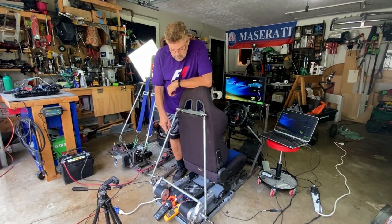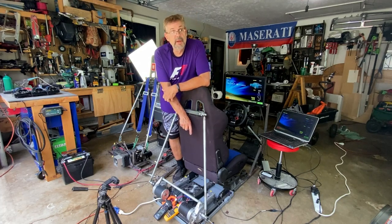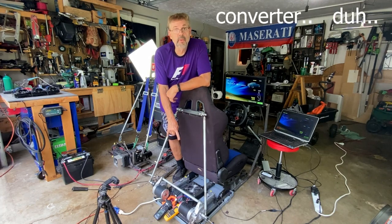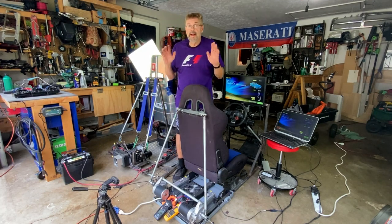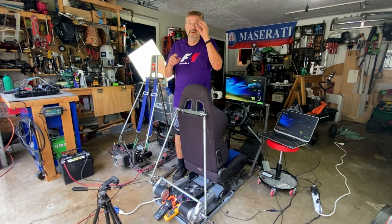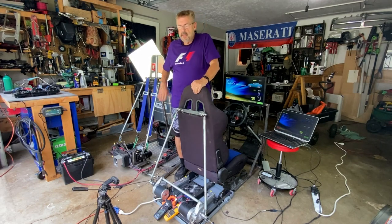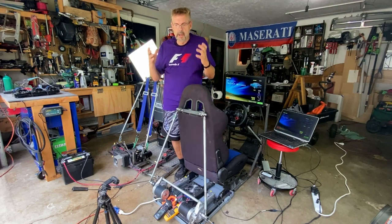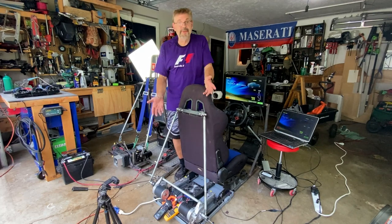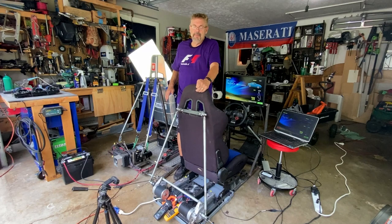Now you know that a 24-volt 25 amp inverter and two of these wheelchair motors at 24 volts work. I don't know what the amps are going to be, so I'm going to take a look at the video just to see what we're pulling. I don't think they're pulling all that much. Certainly not like when I did the brake test, but it does work and I'm pretty happy about it.